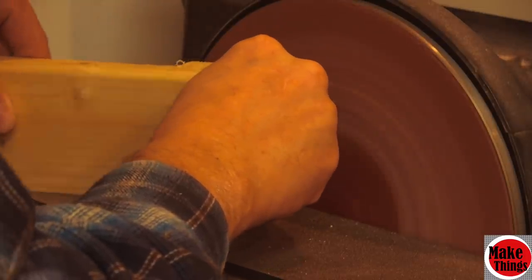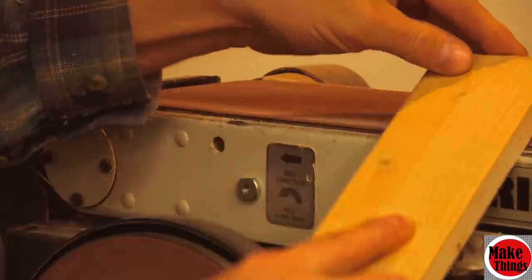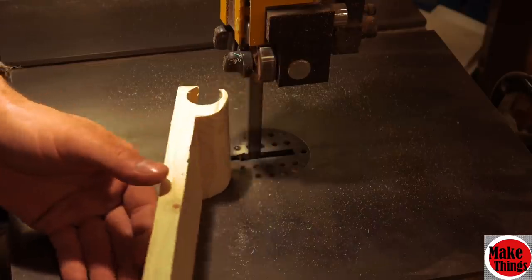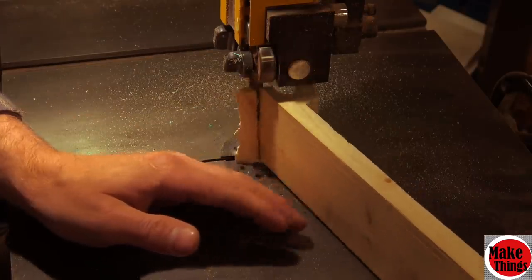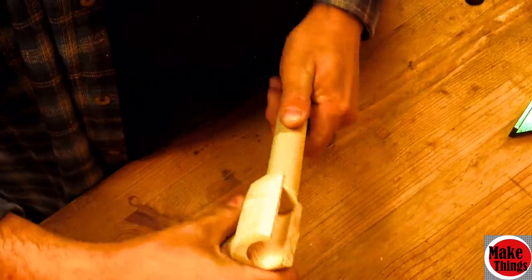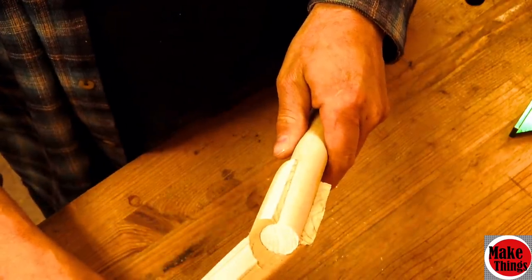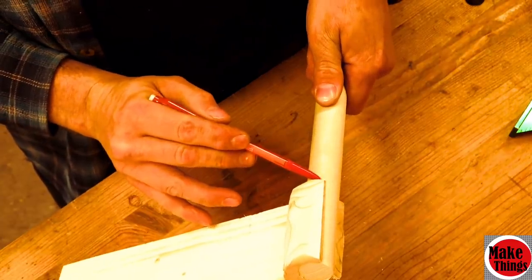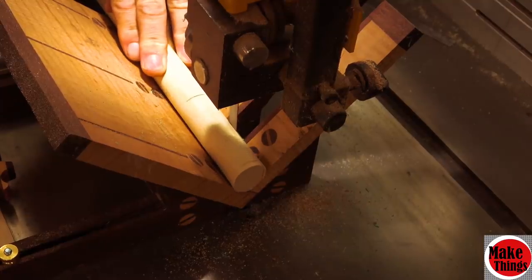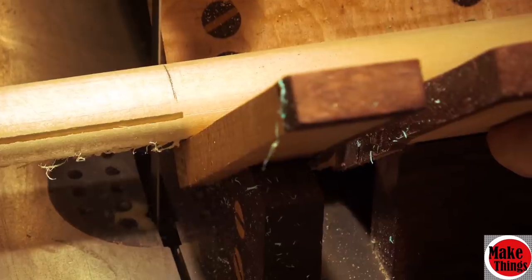With my sander I rounded the protrusion, but honestly you don't have to do it. It's important to cut the drill hole which will house the 1-inch dowel. This dowel will serve as a rotating pivot for the featherboard — one part of the cylinder will need to be flat for the featherboard to be attached. I'm using my bandsaw jig for cutting dowels. If you're going to cut a dowel on a bandsaw, please watch my bandsaw jig video as dowels can be dangerous to cut. That video will be in the description as well.